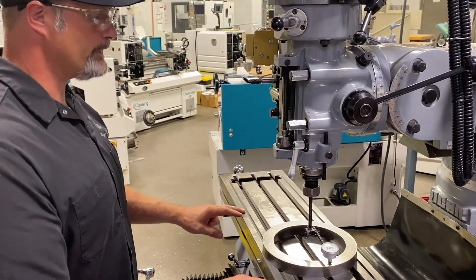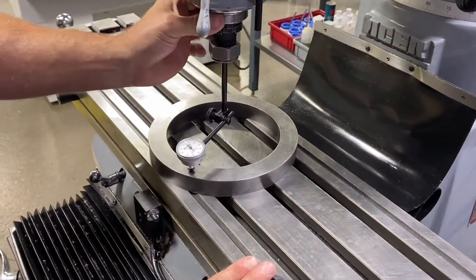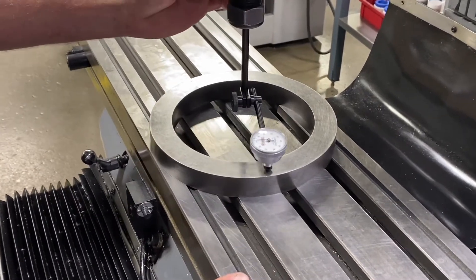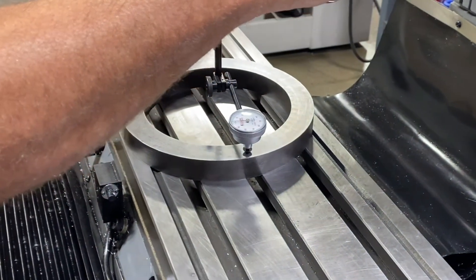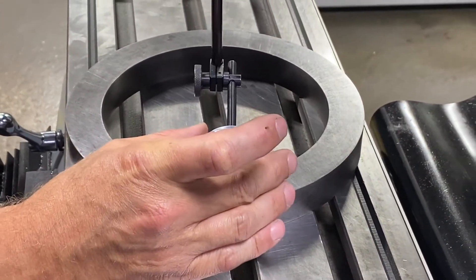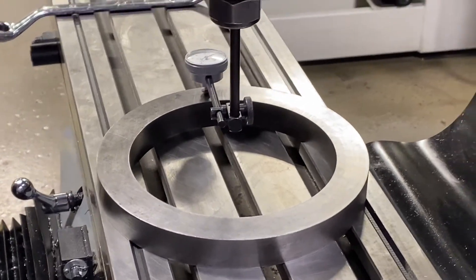I'm going to work this in two different directions separately. Starting with my left to right alignment — that's the rotation of the head. I'll zero out on this side and sweep the indicator over to the other side. I can see it's falling off in the negative direction — about negative 17 thousandths. So I'll come back over to this side and move it into the negative direction to counteract that. I'll rotate the pinion just a little bit — start small, go 5 thousandths negative on this side, zero out, and travel over to the opposite side. It's still falling in the negative direction but now we're only about negative 5 thousandths. So we definitely improved it.